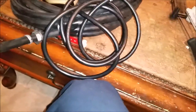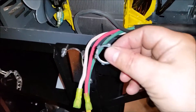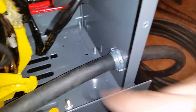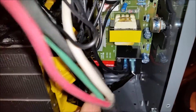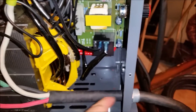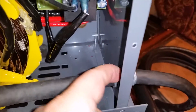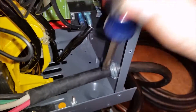We've got to put the nut on — there it is, we'll put the nut on here. Now we've got this threaded on, make sure you have enough pigtail to go from here up to your switch. Once the switch gets in there it should be enough, it could probably come up here a little bit better. To tighten this up, you just get a screwdriver, set it on here, and smack the end with a hammer and that'll tighten it up.